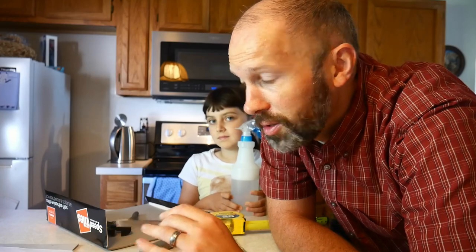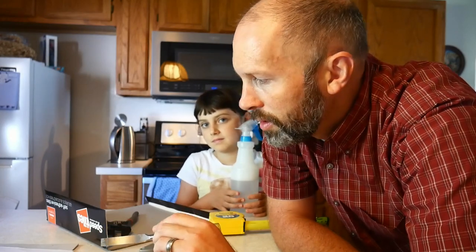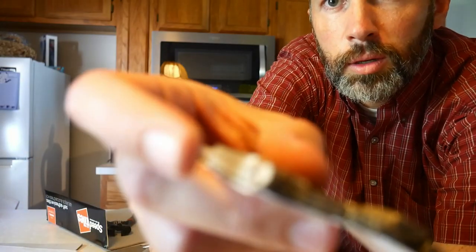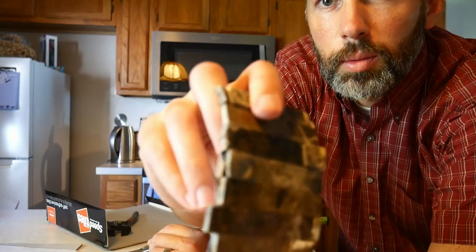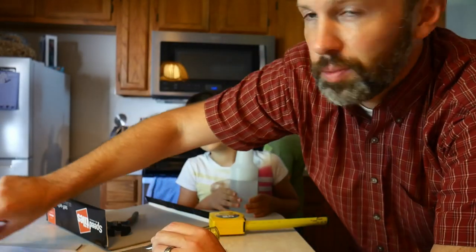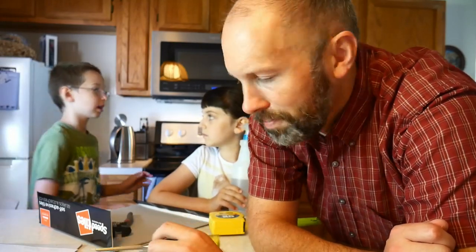So that's something to be careful of when you're doing a project like this, especially with these stone tiles that have sort of an uneven surface to them. Some of them are raised up and rough, while others are smooth and lower down. I think that's part of the problem of getting them to lock together, but just something to be aware of. There is no grout line with this kind of tile, so they have to lock perfectly together, and it's not quite perfect. So, be warned.